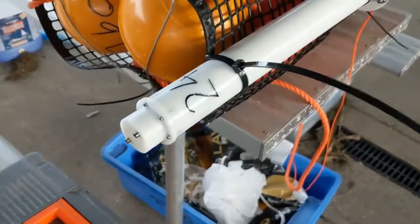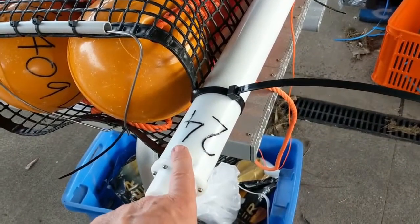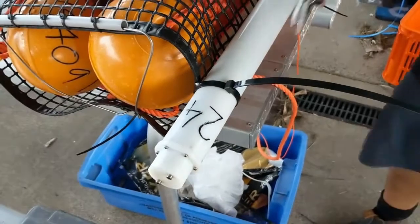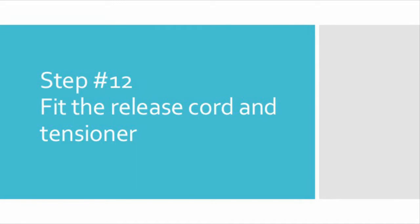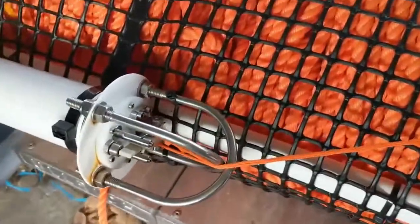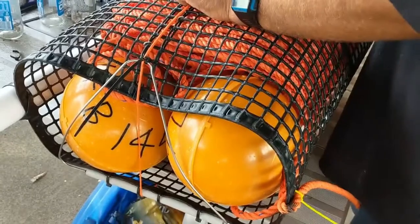On the side of the release there's a Fisher-specific gear marking code — not the release code for the ARC, which you want to keep secret, like your PIN number. This is just gear number 24, and there's a sheet that relates that to the serial number of the release. The release cord pulls straight up through the two links, and there needs to be a good amount of tension on it. There can be no knots or snags in the release cord — keeping it clean is very, very important.